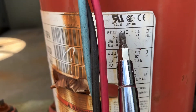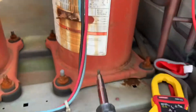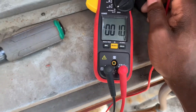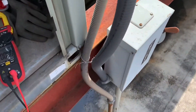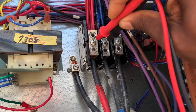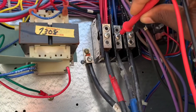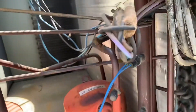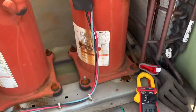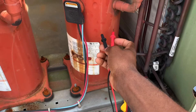Make sure you verify that you have power. This particular compressor is 230 volts, three phase. Set your meter to voltage and check the terminal block — same way you checked the windings: three pairs. First pair — I've got power, 212 volts. Second pair — got power. Third pair — got power. So we have power, the motor has been tested and passed the ohm testing.